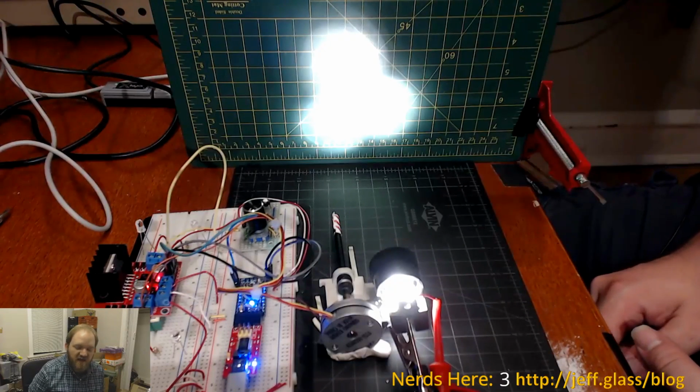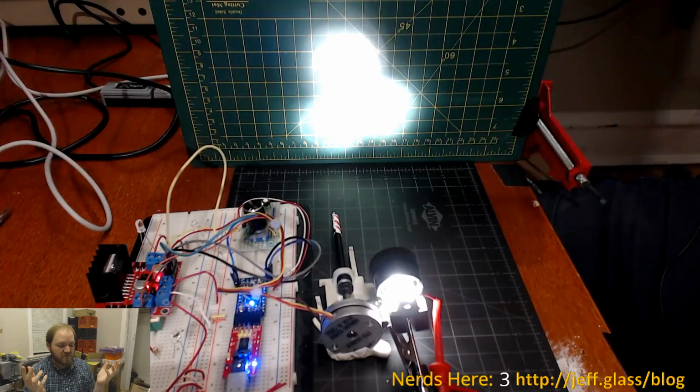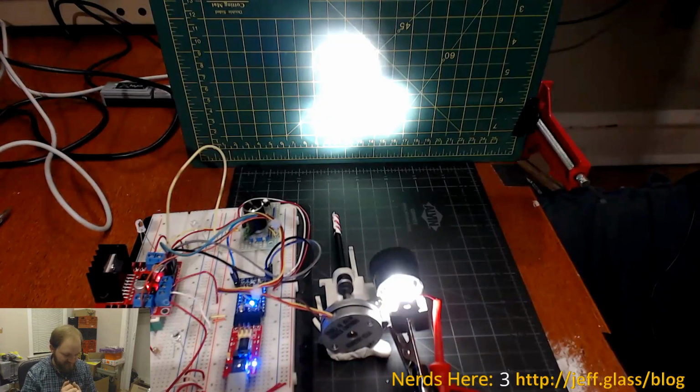Emitter technology in a ColorForce, and again, this is what I don't understand: if you have a Source Four color fixture and you take the lens tube off the front, which for anything but a 36-degree is a single lens, or a 19, a 26, a 50, a 70, a 90, a single lens. If you take that out, what you're looking at is a rainbow constellation of many diodes, which must all be pointed at the focal point, I guess, or whatever optic is in front of them is all pointed at the gate of the light is the only thing I can think. That's sort of where my knowledge of LED fixture optics ends.